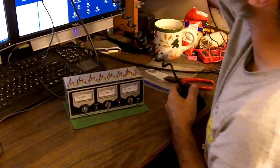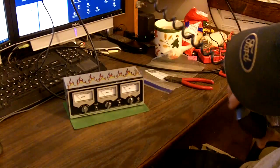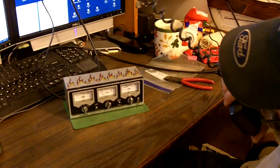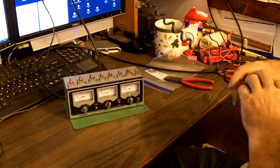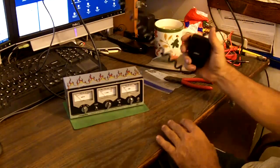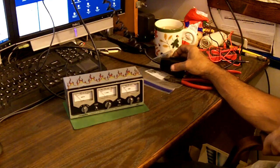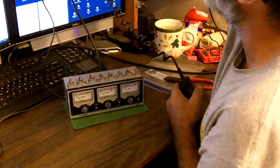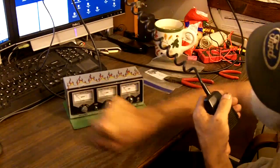Let's see what the Washington does on sideband. I put it up to the 50-watt scale. Oh, I still have the mic gain turned down from checking the SWR. Alright, it went up to the number 1. So it's doing, hey, number 1 from number 1. Doing about 10 watts. The number 1 thing, that's Jerry Miller's numbers that he uses on sideband. He's number 1 in Michigan. So check it out, Jerry. It actually works. It just needed a little bit of soldering, and we have put it back to the 5-watt.